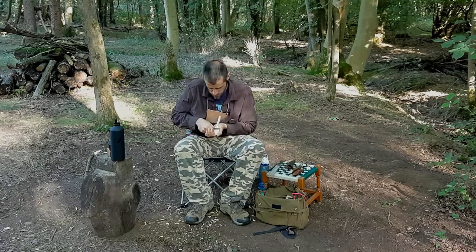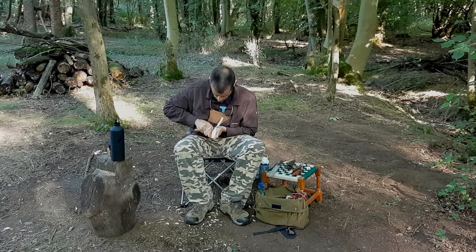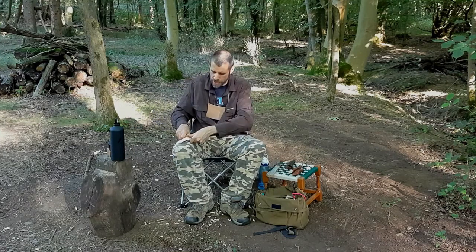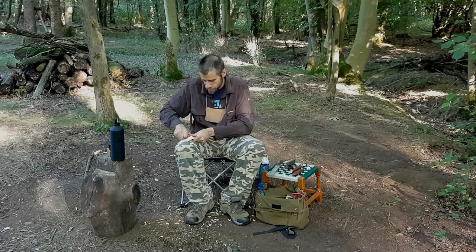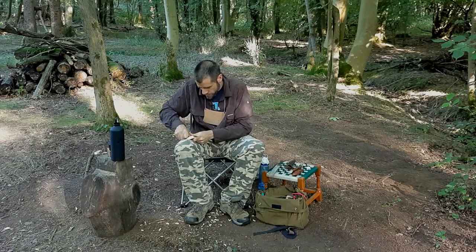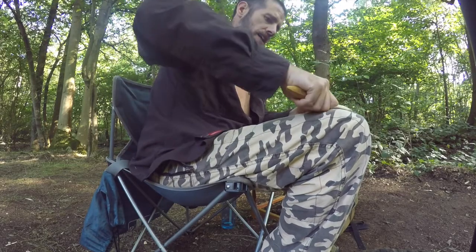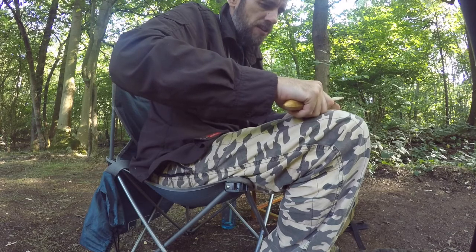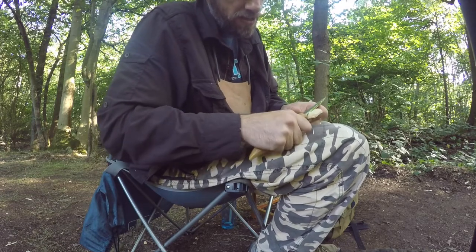That's done the two sides — now I'm going to come around the back here. There's a fair bit of material there, so I'm going to take a reasonable amount off. You can see where the grain changes are, so I can push forwards from right back here. Normally you wouldn't get away with doing it from about there if this was straight wood, but because we had that bend in the branch, it can literally come from right behind the shoulders of the bowl all the way around to the front. I'm going to establish this face using a thumb push — it's a short stroke, but I can put a lot of pressure down onto the cut to use the bevel of the blade as a bit of a planing surface and really guide the edge quite accurately, keeping everything nicely registered with the side facets.